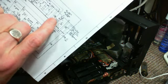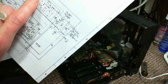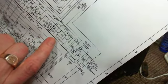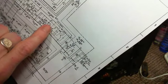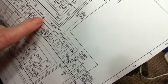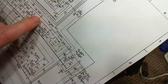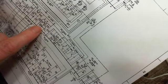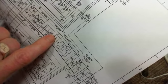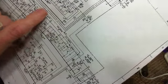Right away, a couple of transistors, some voltages for me to read, and there's that DC to DC converter. It jacks the voltage up from 4.4 coming in from the batteries, and the output looks like 6.2. Oh, there's the 18. Yeah, there is an 18 volt bus coming out of it too, or an 18 volt supply. There's a Zener diode there. So I imagine this is all about voltage control through here, I think. That's my thinking, so that's what we're going to poke around with.